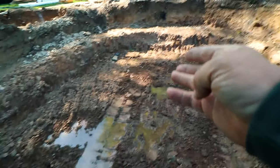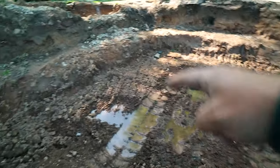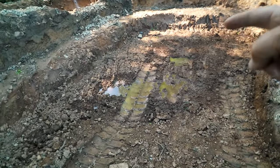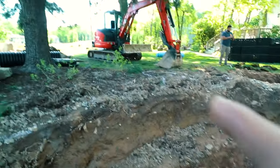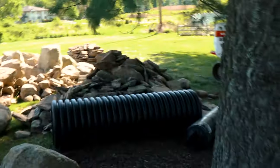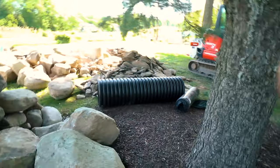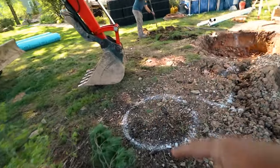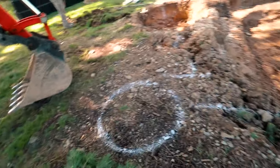Then we're gonna be cutting troughs right through the middle with branches going out to the sides, install fabric, pipe work, and gravel. We wanna take that water out and we're gonna send it into a sump over here. We'll be using a piece of ADS road pipe. That's gonna go in vertical right in this area here. So that'll be in the ground about a foot and a half below the bottom of the pond.